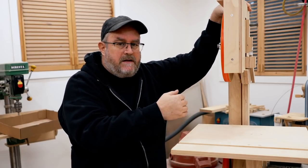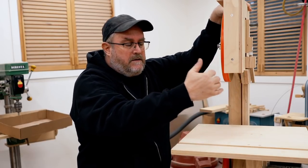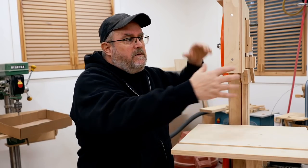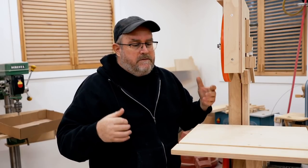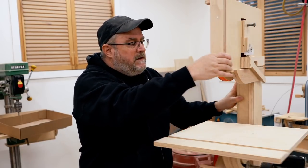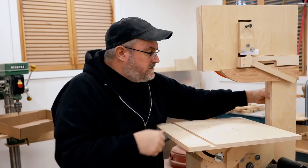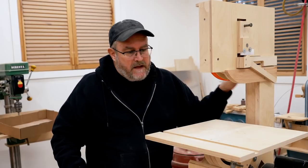As you tension the blade, it's going to try to pull the blade guide back, and that will depend on how far down it is. Ideally you don't want this thing twisting at all, but in practical terms that's almost impossible. The only thing you can do is try to minimize it. So I added that piece on the inside here, and I also added this piece of oak, half inch thick, that goes right across to the other side of the box beam, and that added a lot of strength.